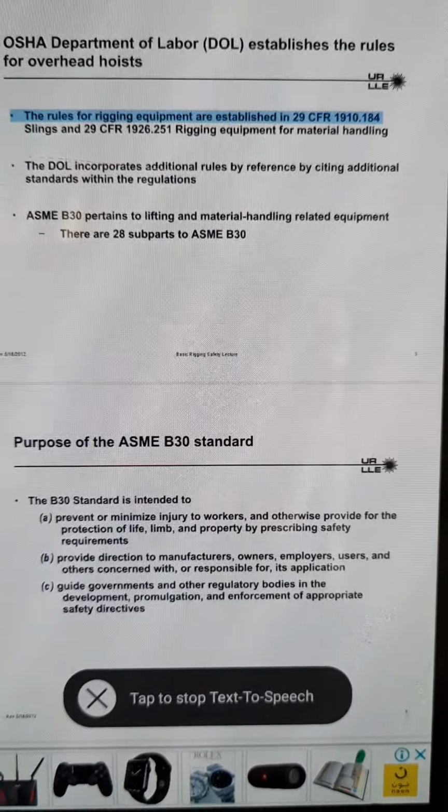Basic Rigging Safety Lecture 20. In a bridle hitch, 2, 3 or 4 single hitches are used together to hoist objects that have lifting lugs or other attachments. Bridle hitches can be assembled from individual components: slings, shackles, hooks, etc. Bridle synthetic slings are permanently assembled units consisting of a number of web slings grouped together on a master link. Bridle slings typically have 1 to 4 legs. Sling ends can be either eyes or various types of hooks.